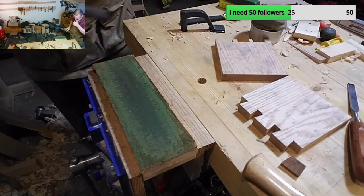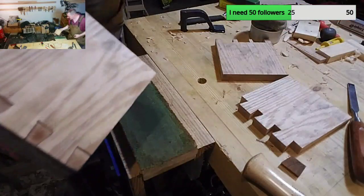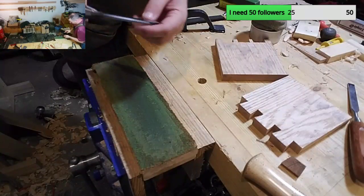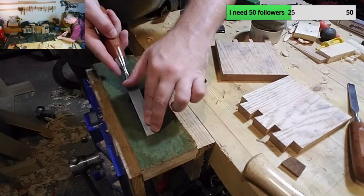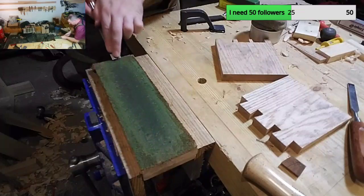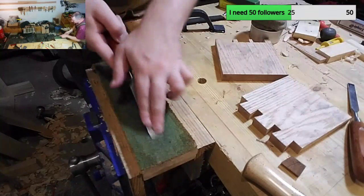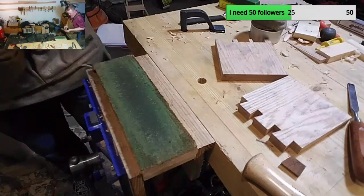I think you may have just missed the fitting of our last dovetail. It's about like that, and it can go a little bit tighter, but we're setting that aside for now. Because before we do any kind of glue up, I have to construct some diagonal braces. But bookends come in pairs, so we're gonna do the second one before we move on to that.